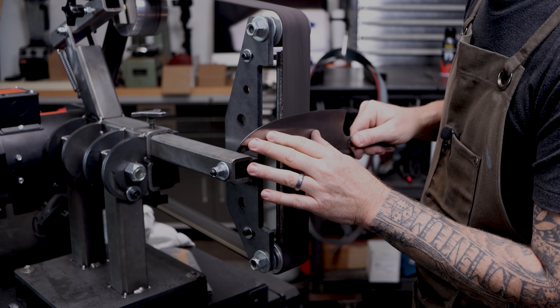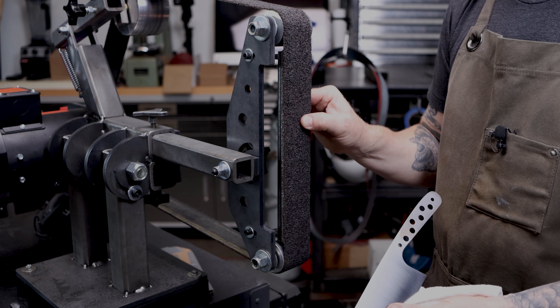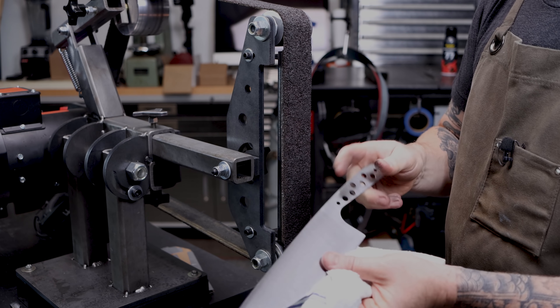Really simple to achieve. I hate hand sanding, so I don't do a lot of it — especially when working with knives like this because they're working knives. I'm not going to put a mirror finish on this blade, it's just going to get damaged anyway. I really like using the surface conditioning belt, especially with a soft back platen, because it adds just another layer of softness and you can really push up against it without doing a ton of damage to your blade. I'm impressed — I really love this system and I hope you guys build one too for your grinder.